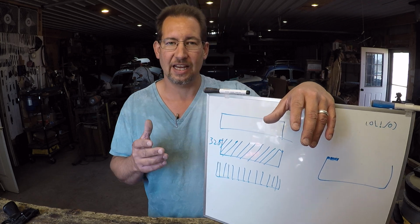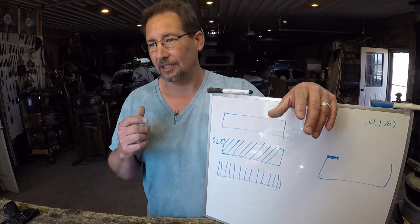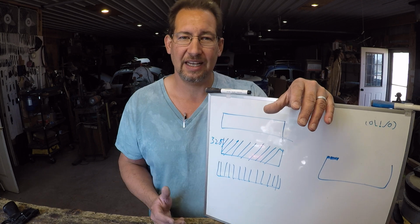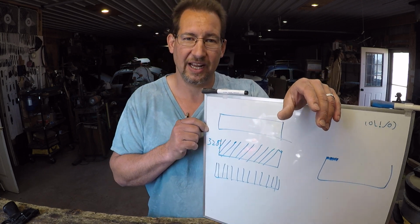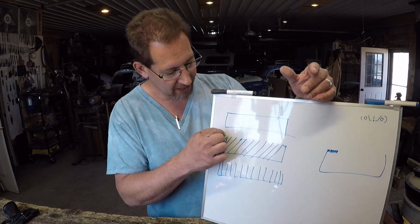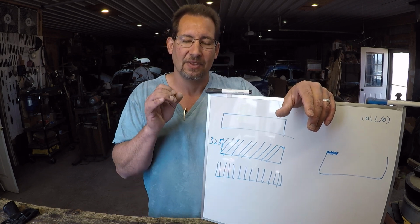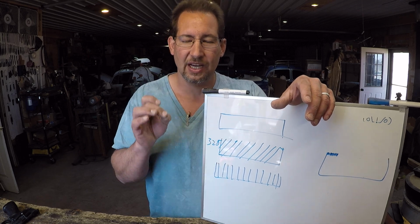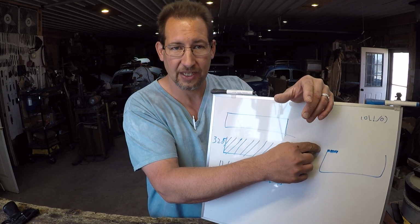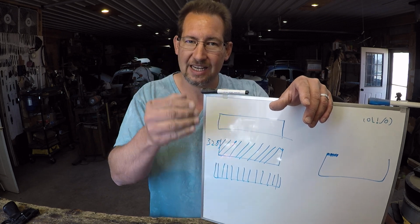So if you're cutting things like rope, cardboard, leather, wood, baling wire, fabric, tarps, any of that kind of stuff, typically that 325 grit edge or thereabouts, between 200 and 600 grit or maybe 700 grit, somewhere in that range, is going to give you enough space in between those teeth that it's going to be a nice aggressive edge, okay? And there's the key: nice aggressive edges cut with less force than these high grit edges, okay? Because with these high grit edges, the teeth are so close together that they can't take enough of a bite.